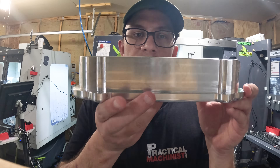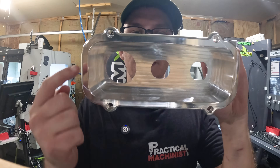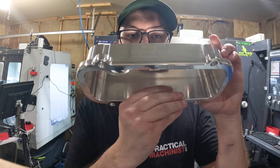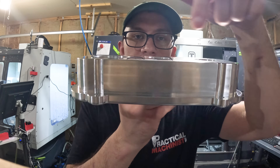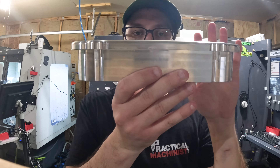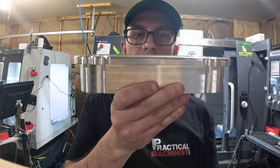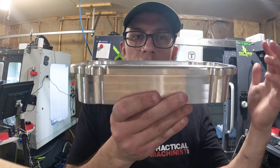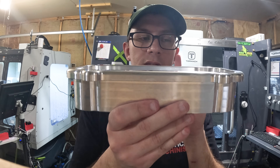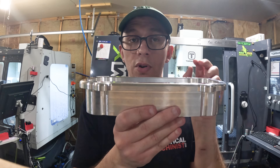Here's the item. This item is flat here and here. On the surface it's got some contours so you have to cut soft jaws. The way I did these out of a billet was I did this side first, did all this machining, flipped it, and then I could just hold this on parallels. I didn't have to worry about these contours. The reason I did it that way was to avoid soft jaws and any variability in that aspect. But one thing I did do, and I shouldn't have done, is I should have made this a three-op part — I did it in two operations.